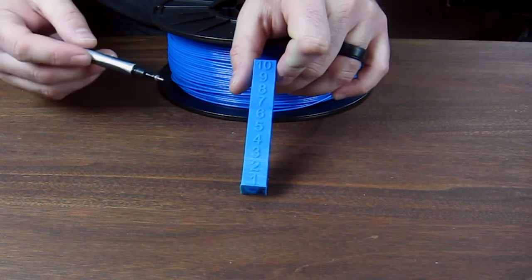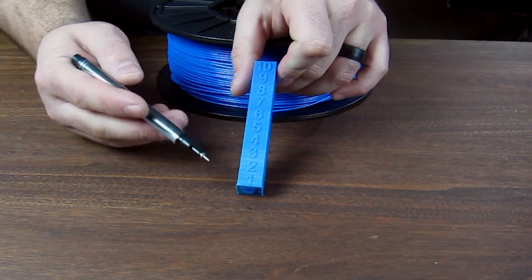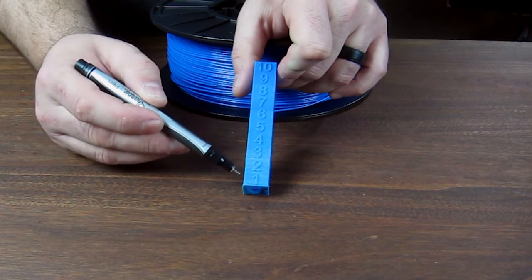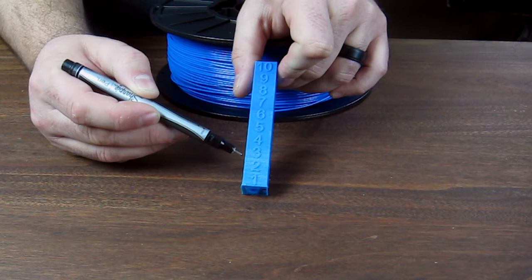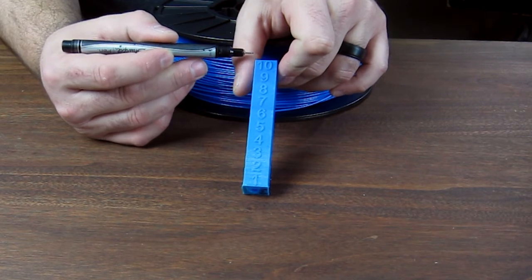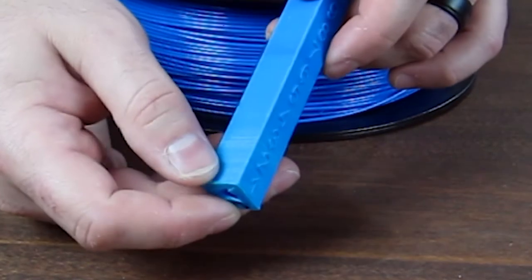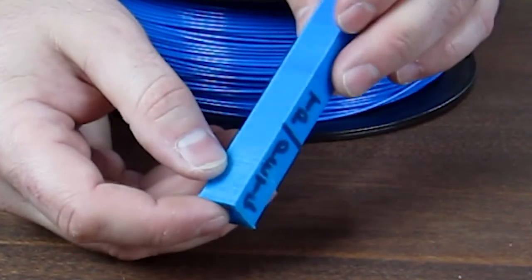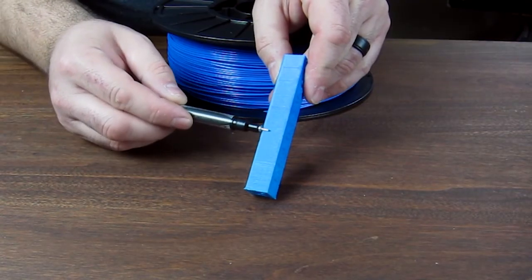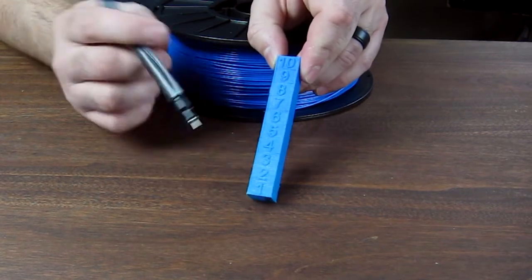Toner Plastics has a spec sheet on their website — I'll put a link in the description — that gives you a temperature range for the hot end. This particular PETG ran from 250 to 230°C based on the data sheet. So I started at 250, dropped two degrees at a time every 50 layers, and ended at 230. You can see things down here at the very bottom are pretty gross — a lot of bubbling, warping, and discoloration. You can really start to see a shift around the 240 range, and colors really start evening out in the 230s.